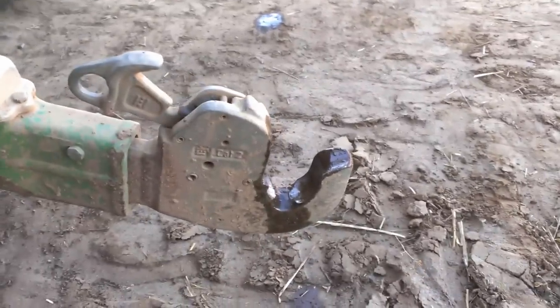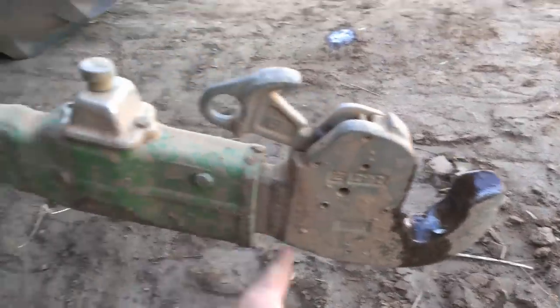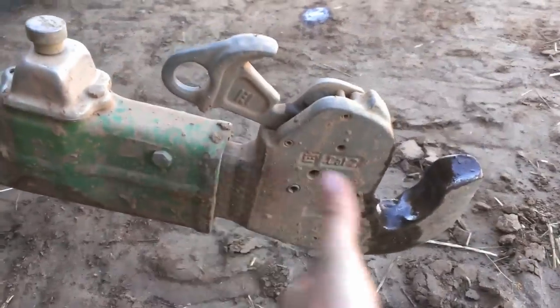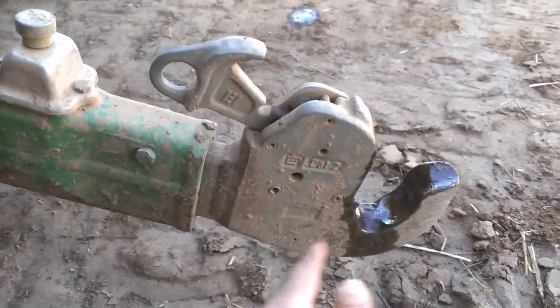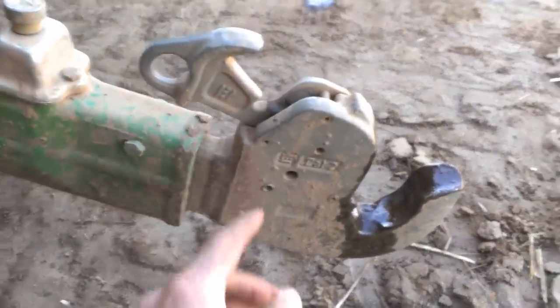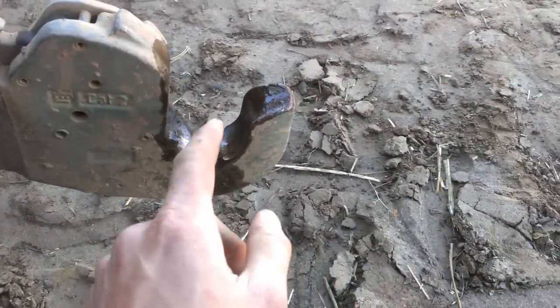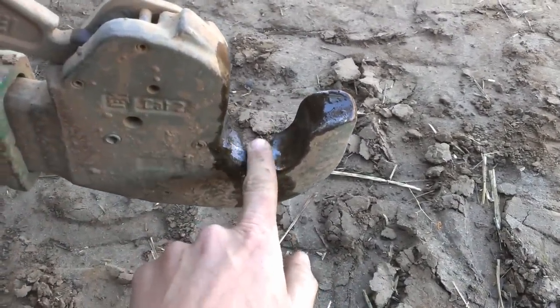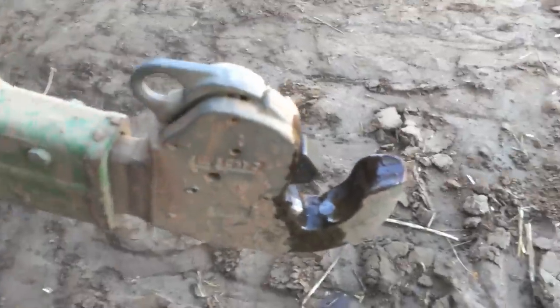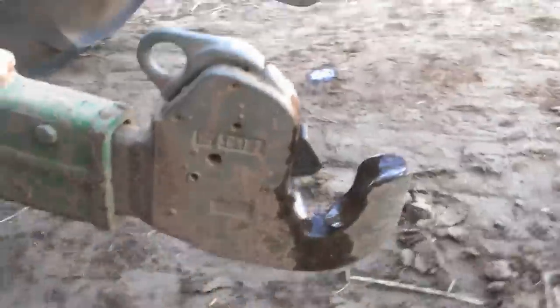This is what we did when we got our linkage mower. Basically, that part there is the original adjustable end that has the ball on it. I just bought these as a kit, one for each side, chopped the ball off and then welded these on. There's a ball that goes on your pin, which you'll see in a minute, that fits down into that coupling and then you release the hooks and they're locked in by that top bit. And that's pretty much it.